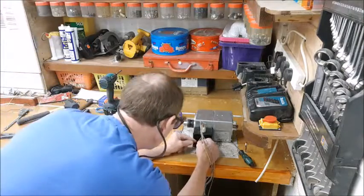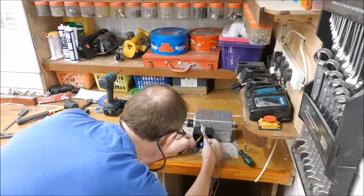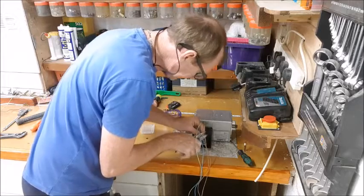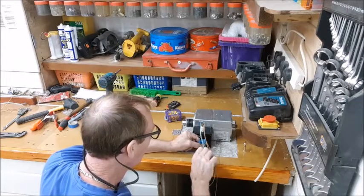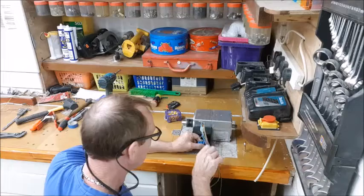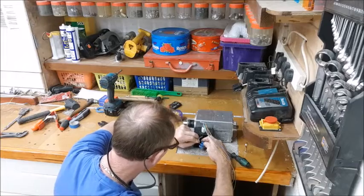Right now then, wiring yellow to yellow, brown to green, blue to black. That's quite logical. At this stage, this is my choice, because these are new colours, as long as whatever colour touches this side touches the other side as well. It's up to me which way around I'm going to go. But I put a yellow sleeve on here and I've got a yellow wire. So there's my start point.